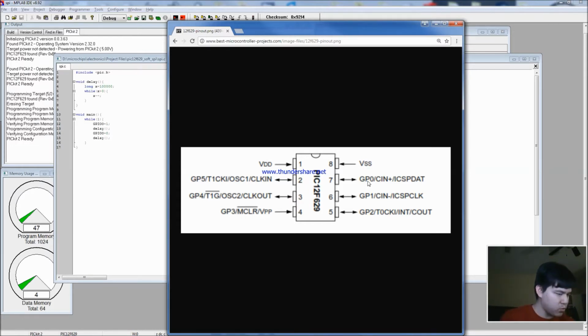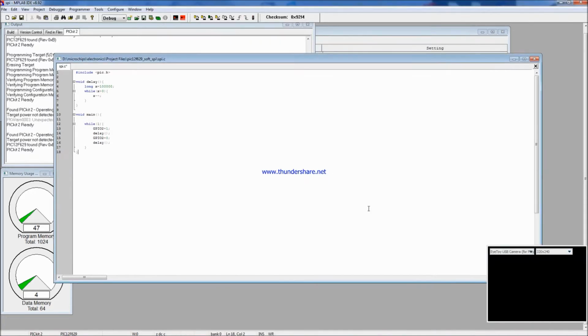take a wire as well. So all I'm doing is going to the 7th pin, hooking up an LED, the positive side, and then on the other side, taking a wire to ground. And I'm just using any old bit of wire that I have. Actually, yeah, VSS, I do not need a wire, I just realized, because they're right next to each other. So pin 7 and 8 go to the LED positive and negative respectively. So now I have an LED plugged in.